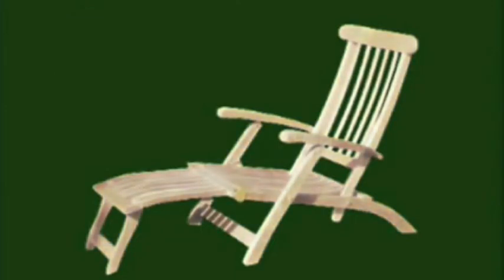It is very important that before applying the patinizer to a new golden brown teak, you first allow this brown teak to weather in the open air for 4 to 6 weeks. After a few weeks, the golden brown colour will change to a pale yellow. At that point, you must be patient for a few more weeks. The patinizer should be applied for the first time once the teak has become almost colourless or pale grey.